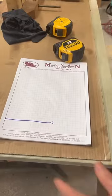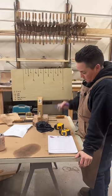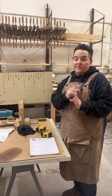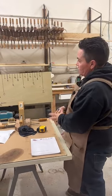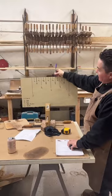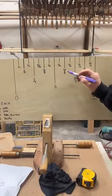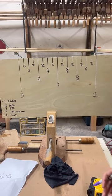So, without having to reduce fractions or add any kind of fractions, all you need to do is take your first measurement. Let's say it's 10 inches, and 10 inches is what you want to add or subtract. This works for subtraction as well. So if I have 12 inches and 5/8, 12 5/8 would be my measurement, that would be here. Doesn't matter what this is, each inch breaks down to be the same. So if I had 12 5/8 and I want to minus 3/8, I could either measure out 3/8 with my tape measure. Look down here.